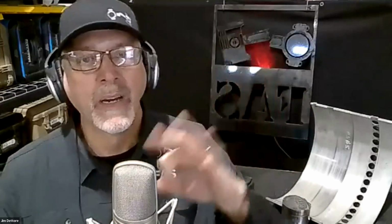just kill durability in any component is three-body abrasive wear. And Mike, that's when we take those surfaces, those fairly tight clearances, and we put an abrasive contaminant or a third body between those sliding surfaces or rolling surfaces, and it starts to do a lot of damage very, very quickly. But one of the really bad aspects of it is every time it scratches a surface, it generates secondary debris. And if you scratch a metal surface, that debris is very hard, and it's hard on other parts, and it can lead to catastrophic failure.